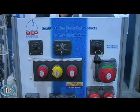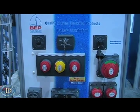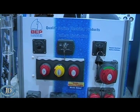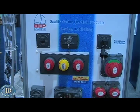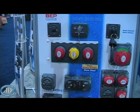These are our new motorized battery switches. They are designed to mount as close as possible to the battery bank, then run a light gauge wire up to your helm or switching stations. This eliminates long runs of heavy-duty copper. It's a very cost-effective system.